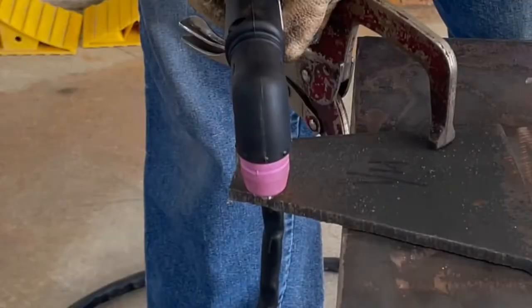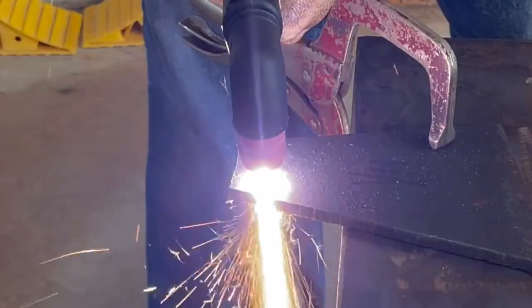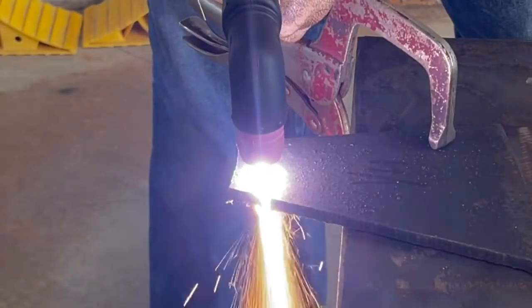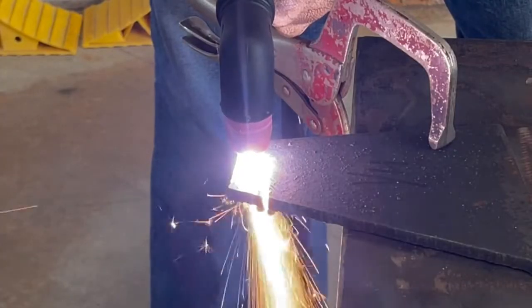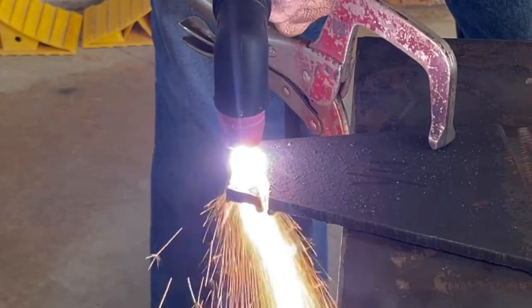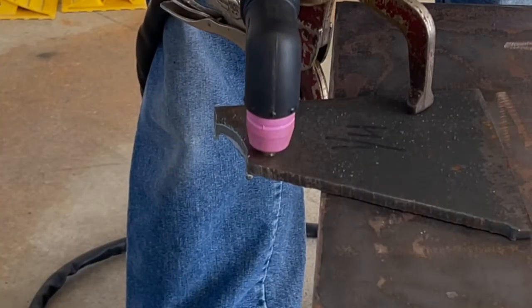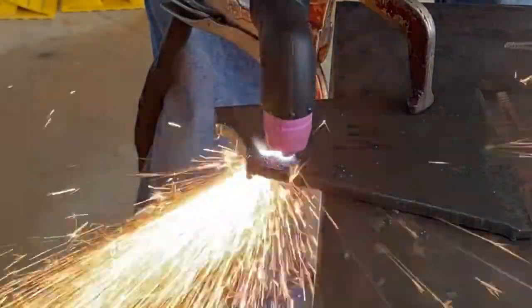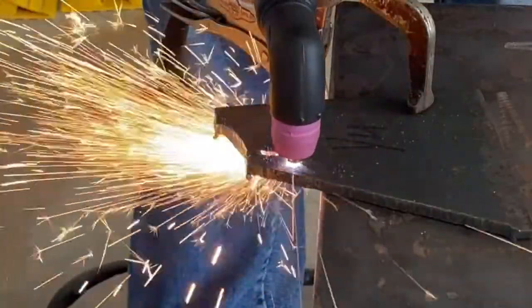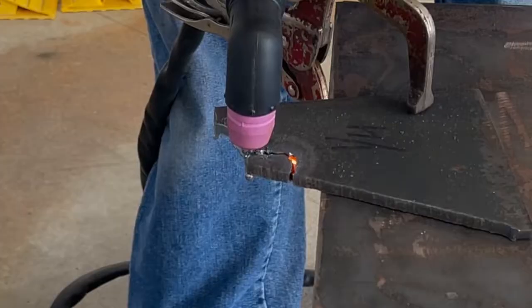Now we're up to that same piece of 1/4 inch. Once again, 1/4 inch cuts it just fine. You can see I got a nice heavy plasma stream underneath the material. Had to slow down, but every time you go up thicker, you just have to slow your rate down. Cuts through it just fine. It's not a problem. Here's a pierce. Even pierces 1/4 inch. Fairly impressive.